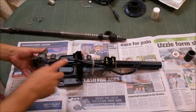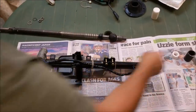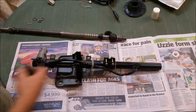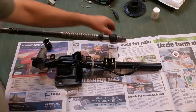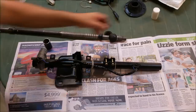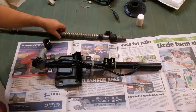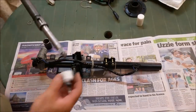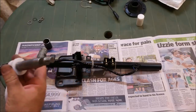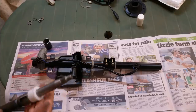We've still got this spare bit and that is designed to snugly fit - there's no fore and aft movement, which I'm really happy about, yet it still slides. It's a very dense material. We've got that right, and also the outer diameter is an interference fit. There's a ledge down there so I've done it to a predetermined depth. I think we can knock that in, let's give that a tap.